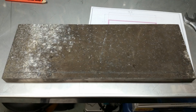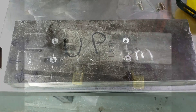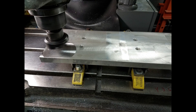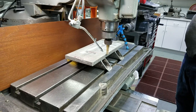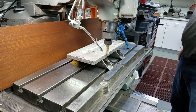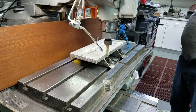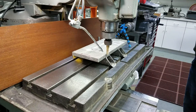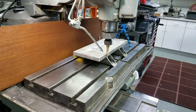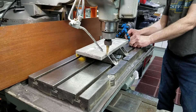After running a good copy of the part in MDF, I grabbed my piece of magnesium stock, which you can see is really grubby from sitting on the shelf for about 25 years, and then ran a fly cutter across it to surface it and make it clean again. After that, I was able to set up my good piece of magnesium onto the standoffs and do all the machining operations on it. Fortunately, I had no errors.